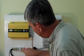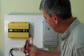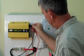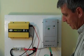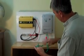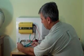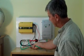Now you've got a plus and a negative terminal that we also attach our wires straight to our inverter, and they get plugged in right here. We still have to get some crimps here for our connectors, but we have two number 8 wires that are also going to go to these lugs. And these are going to be our charging wires to the battery — they're going to feed back out, attached just like that. That's what it's going to look like.